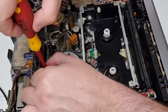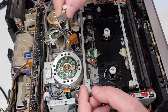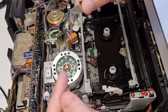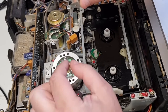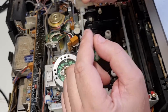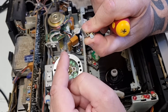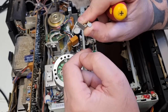I'm just taking the earthing strap here — the little earthing contact goes onto the top. Sometimes these also need a clean. I find that these contact points can have problems as well. Normally it's just dirt and grime from decades of use. Also the tension of the metal there can be a little bit wanting, so sometimes you need to bend it back a little bit.